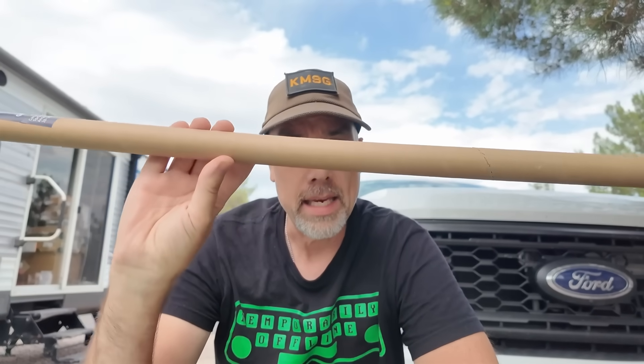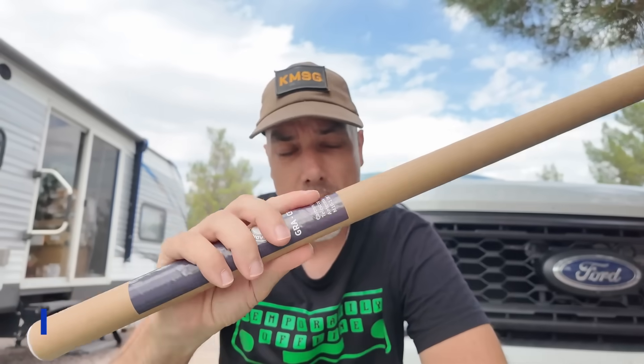First up, this is a car-mounted antenna with a 3/8-24 thread at the bottom — but we're hams, we can adapt that to anything. We can stick it on a tripod and use it in the field. Being a car-mounted antenna, it is rated at 28 to 29.7 MHz, which sounds like you can probably get 10, 11, and 12 meters on that. We're going to find out. And in a future video, we're going to do the other carbon fiber telescopic masts. Be sure you're subscribed for when those come out.